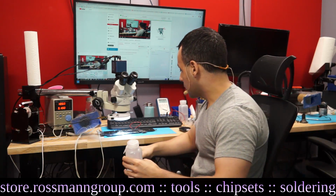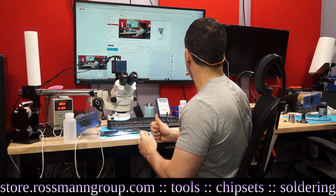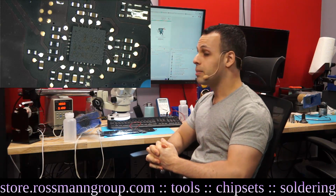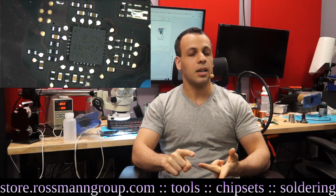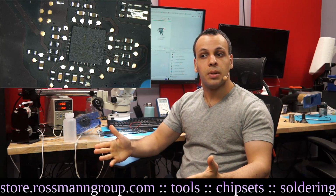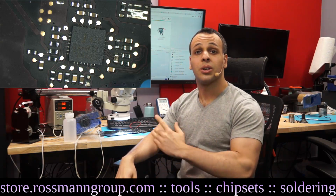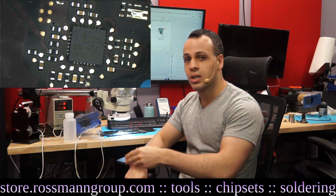So first thing we're going to do here is get our board set up and on screen. Over here, we have the ISL 6259 chip on an 820-3332 board. This is for the A1398 15-inch Retina MacBook Pro from 2012. This machine has a dead CPU, so it's completely worthless to me. This model also has a number of issues it's been recalled for, so it's no loss to me to use this board as an experiment because it's pretty useless to me anyway.